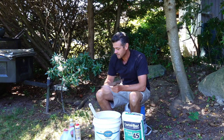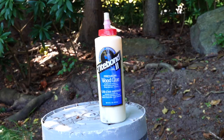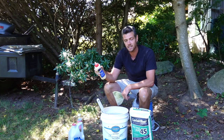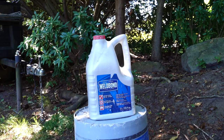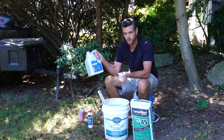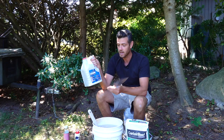In terms of adding glue — what kind of glue? I get this question all the time. Basically just wood glue. You can use actual wood glue; even Titebond — I have regular old Titebond 1 in this Titebond 3 bottle. What I usually use is Weld Bond, which is like a wood glue — it's a PVA glue, polyvinyl acetate. Joint compound's main ingredient is vinyl. PVA glue is the binding ingredient in mud, so that's why I choose a product that is basically the same. We're just adding a little bit more of the same.